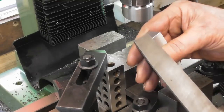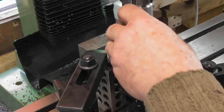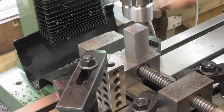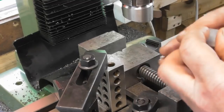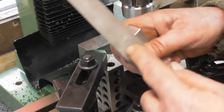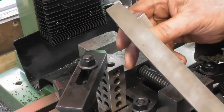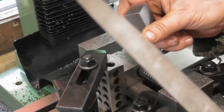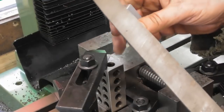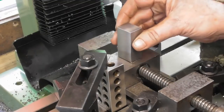And then I think rather than use a stud with a nut on the top, I'm going to use an M10 cap head, and then do a counterbore for the cap head so that I can lower the overall height of it to below the bed line of the vise, so they won't obstruct anything. Yeah, and that'll be then a decent set of clamps for this vise. So going forward, I can design and make the clamp down for the other vise.